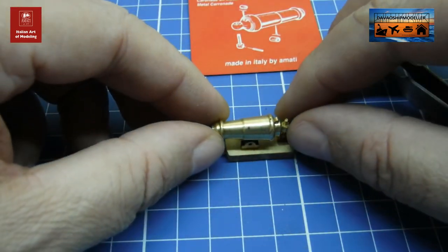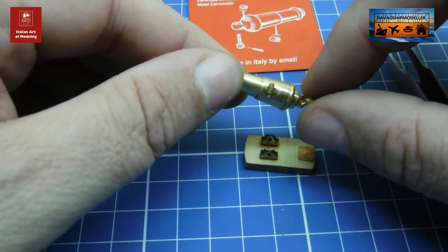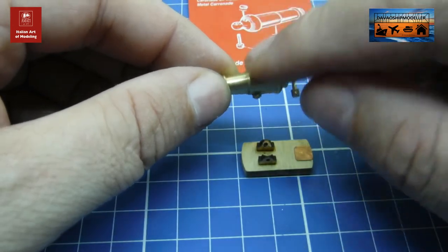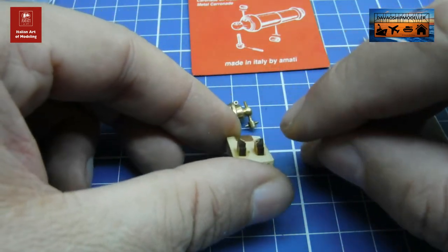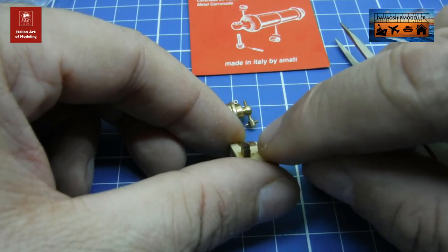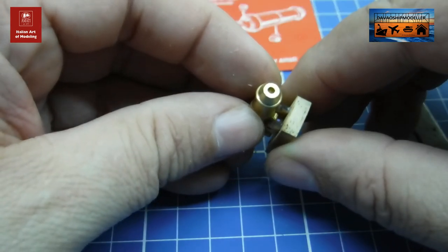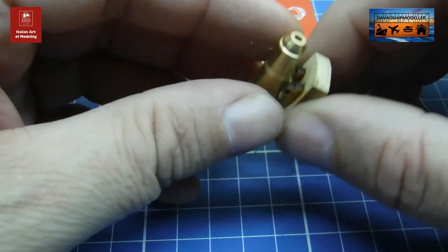So, okay, you can see that I made some modifications to this because they have a problem. After we assemble this ledge and also the cannon, we have to disassemble it because we want to stain the wood and we want to paint the cannon. That's why it has to be removable. And what I was showing before, I beveled the top edge of the hinges so that I can slide the stern cannon in these hinges, and that makes it removable.